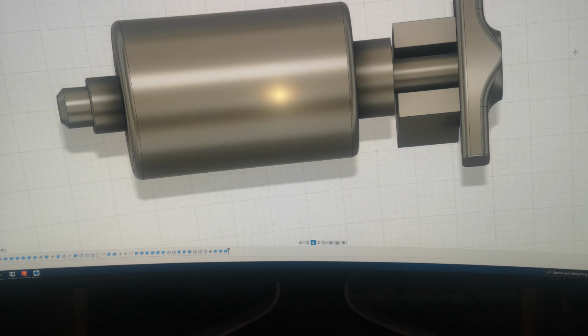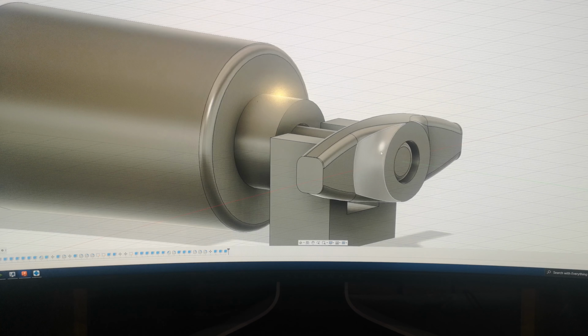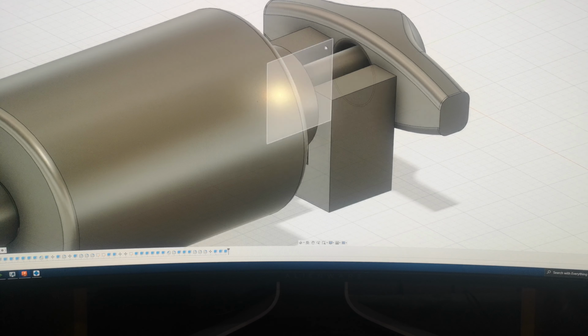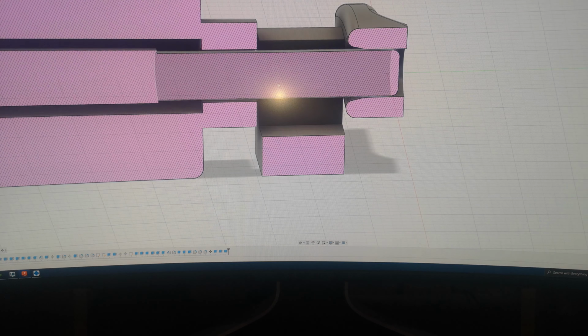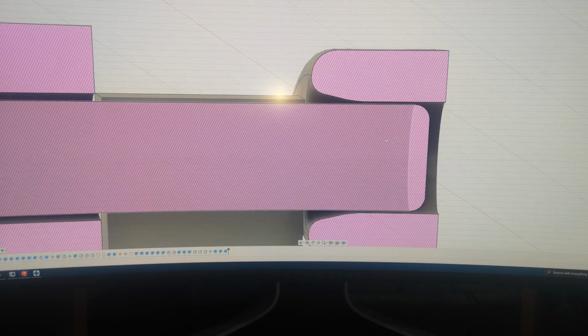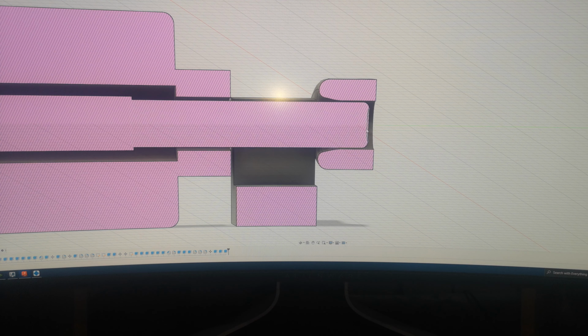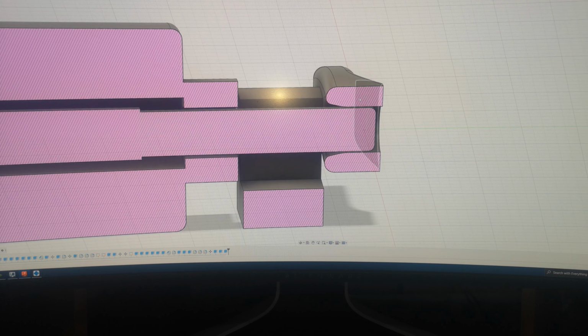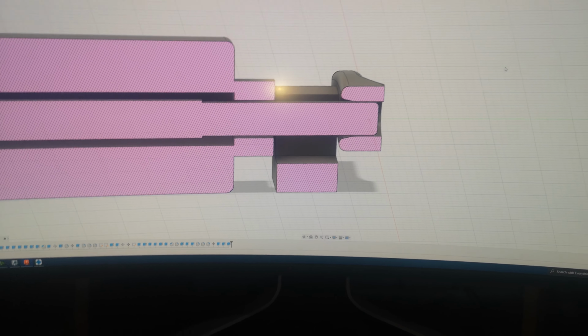But basically, my idea was to take a resin printed bracket that has a chamfered, filleted thing to guide the pin into it. And the idea is that when the pin homes, it has a little thing that holds it and reduces the amount of motion so that it can't rattle. So it secures it at the end here, which helps to fix that issue. Now, that did partially work, but...